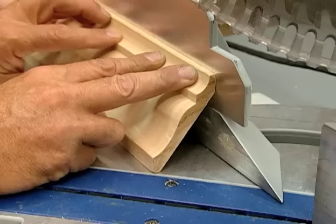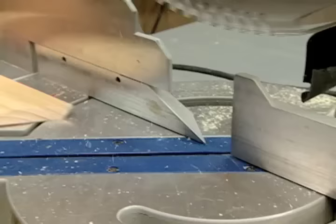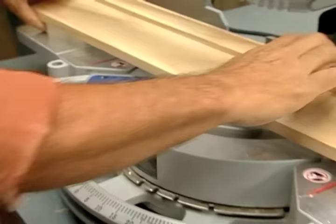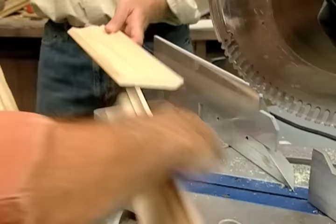I'm going to slide the molding over and make my first cut. The first cut has been made. Now I'm going to make a sister cut, holding it tight against the wall. Now we bring it together - we have a scarf joint, a nice fit.